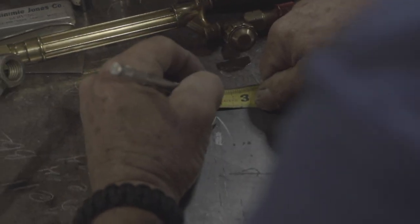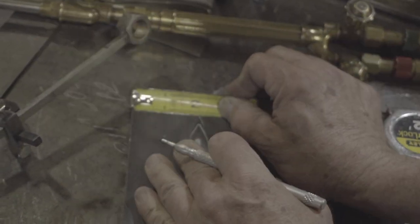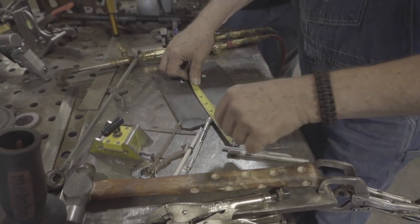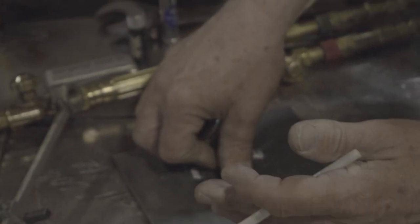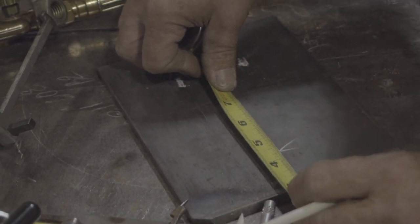What's a scribe? A scratcher. You can really rip a good sharp line in there if you're laying out bolt holes and stuff for centers and you've got to do a bunch of drilling, you might want to start using the scribe. And then you can come in and center punch that. So we do this at inch and five-sixteenths. I've got a bevel on here, so I'm going to burn an inch. I'll come in here and do this — I'm a quarter inch away from it because I want good material in my circle. We said five-sixteenths, so from 3, I need to mark that as a reference. We want our line out to that point — five-sixteenths falls right here. We've got an eighth, a quarter, a sixteenth, five-sixteenths. And that's where we need to pop a center punch mark.